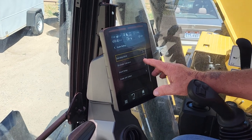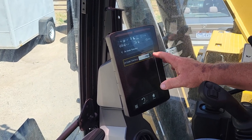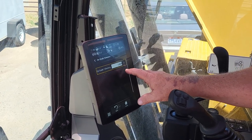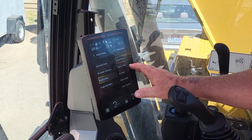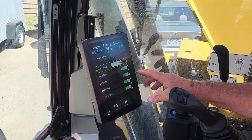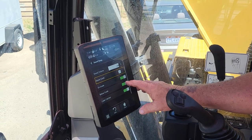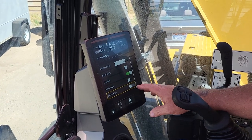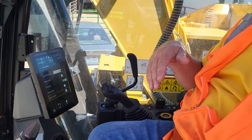Great settings on this — I kind of leave these alone once I've got it set up. Your tolerance on this is 082. If you guys play with this to get it finer or coarser, take a picture of that with your phone so you remember where to put it back, because that works good right at 082. That's within a tenth. Your sound setup — I'm going to drop that to low because you can still hear it very good. I'm going to turn above and below alerts off, and you don't have a laser catcher on this, so I'll turn that one off too.